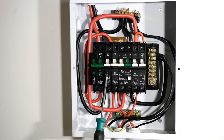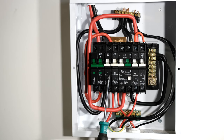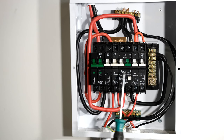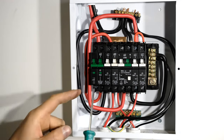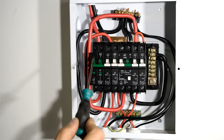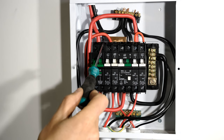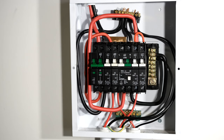This is a common layout because of something called nuisance tripping. If you do want your stove to be protected by earth leakage, you'll have to move it to the earth leakage circuit, and your stove's neutral wire must also be on the earth leakage protected neutral rail. While you are working here, be very careful because even though the breaker is off, those incoming terminals are still live unless you switch off the power at the street or outside.